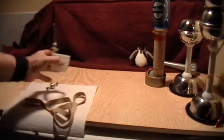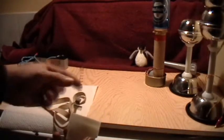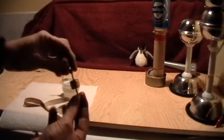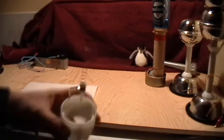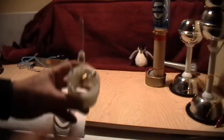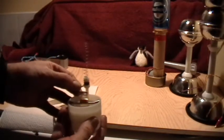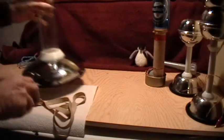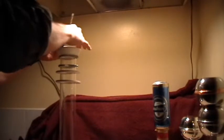The business end at the top — this is a little support bearing unit, and the top brush or comb, and a spring that will make contact with the top capacity when we put it on. This is the top roller assembly — that's a brass roller and a steel shaft running in two little ball bearings. The way I designed this is it just drops in there and is free to find its own position once you've got this on there with the belt in place, and the brush swings over the belt when the system is in operation.